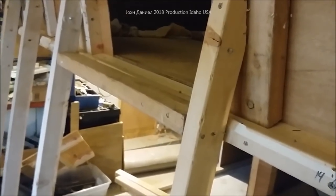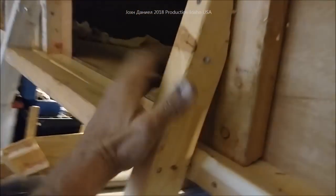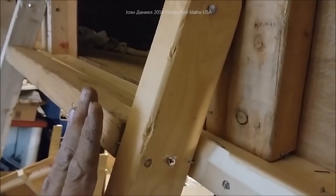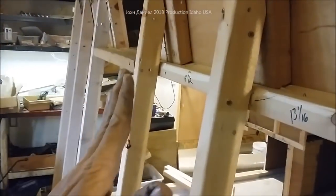There is the frame-out for the air conditioning unit. I used nails in a few places, but everything else is screws and glue. The nails helped me tweak and straighten the boards a bit. That same paneling will come out right here for the air conditioner to mount on. The air conditioner has plenty of room — we're at five and an eighth inches here. At the base there are no vents. It's actually six and five-eighths inches before there's a vent, so even with the seven-sixteenths added, there will be a half inch before the row of side vents. The top is completely open, and we're putting in a metal pan with a drip edge over this area.